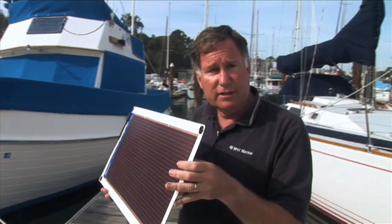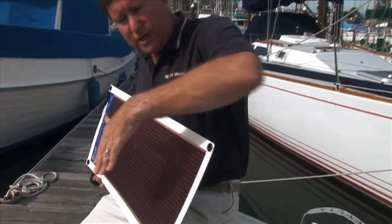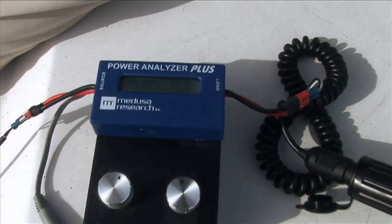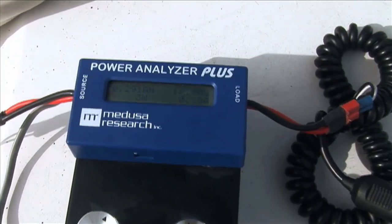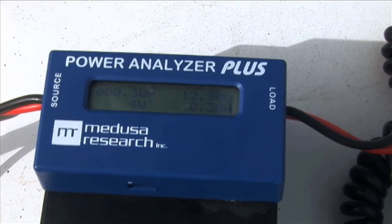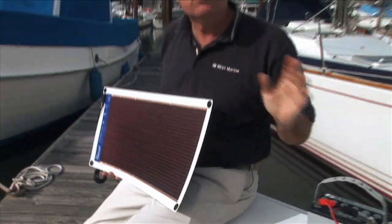What does this prove? What we were saying before: you want solar panels perpendicular to the sun, you want the brightest possible sun, you don't want cloudy days, and you don't want shadowing. Even a small amount of shadow will make the power go down dramatically. And finally, you want to keep your panels cool. I'm just going to put my arm over this — you can see it goes from 2 watts — and pull my arm away and now we're back up to 3 watts, and back up to 4 watts. Just a 10 or 15 percent shadowing has a dramatic effect on the panel's output.